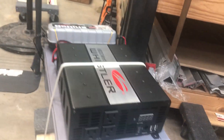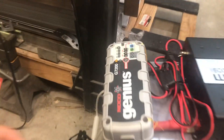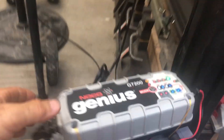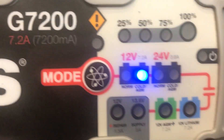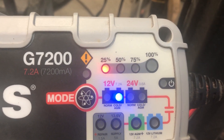That's how the inverter works to plug in. And then when it gets low — ideally you don't take it down below 50% charge — you plug in the smart charger and it starts up. It remembers what it used last, so it went straight to AGM and it's charging.